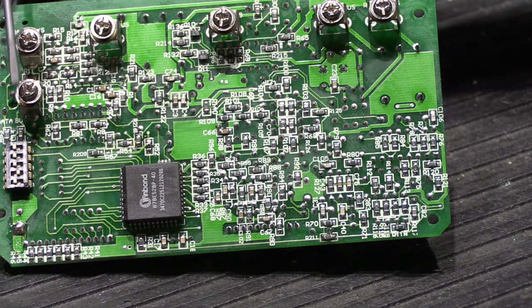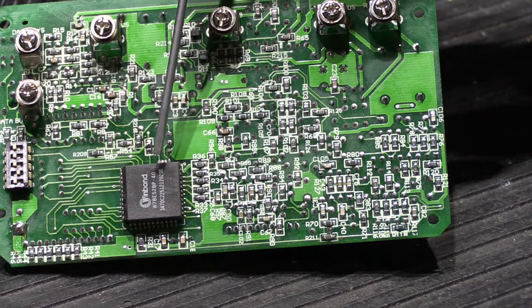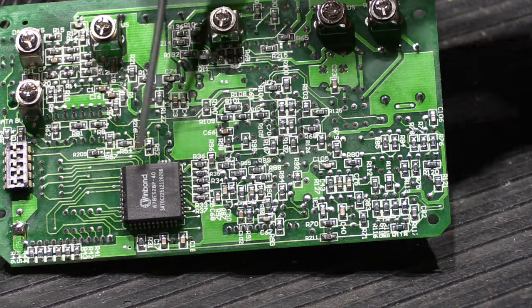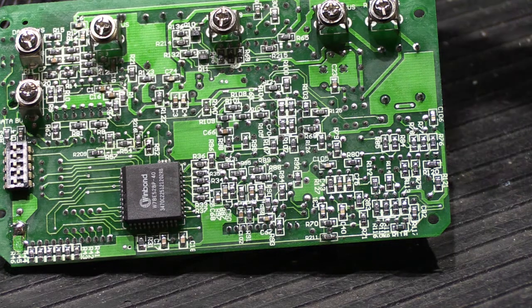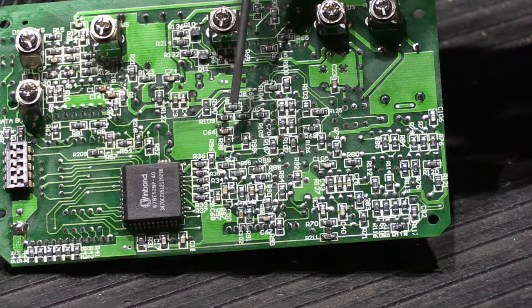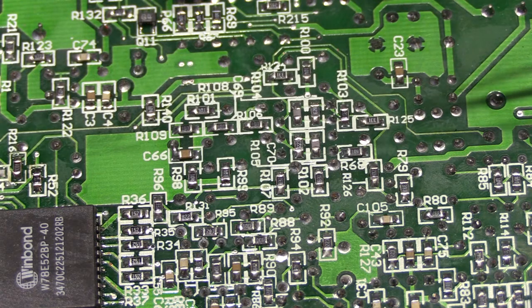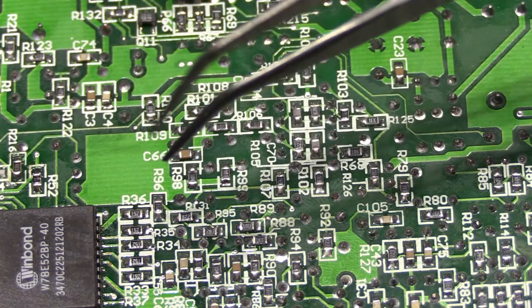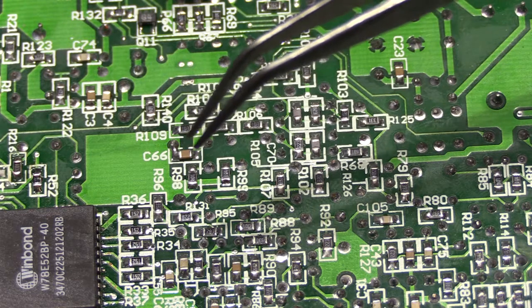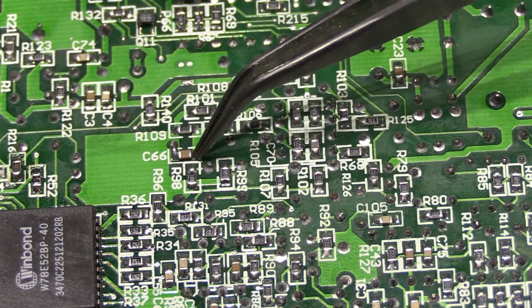On the back side of the board we have screw terminals where the speaker wiring is terminated — the black pair, red pair, and orange pair. Down here is the little five-position DIP switch package that lets you assign the station an identification number. Here we have the microcontroller that's programmed to allow the station to operate as it does. And all of these little shiny bits here and here and over here are miniature surface-mounted components — primarily resistors and capacitors. Here are my tweezers, which is what you use when working on surface-mounted parts.